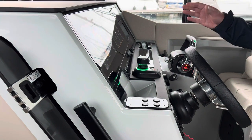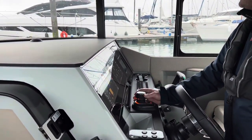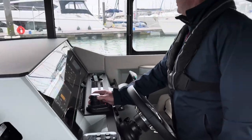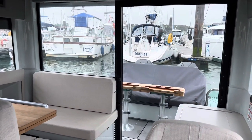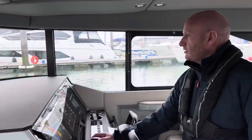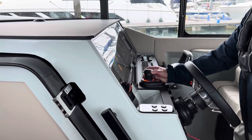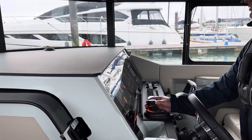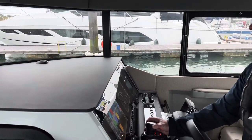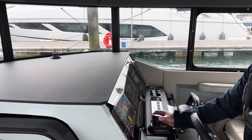If you're not sure, just stop and it sort of resets itself — those engines go back to the position they'd be in if you're going forwards or backwards. You've got lots of time to do this. I'm going to turn the joystick just a little bit to square myself up again, then push it sideways. It's nudging forward very slightly, so I'm pulling back on the joystick. My bow's starting to go to starboard, so I'm squaring up there. And as you can see, we've got a nice straight movement now coming alongside. Nicely and slowly we go pretty much sideways.